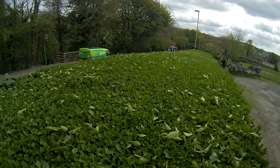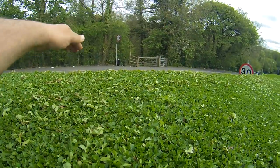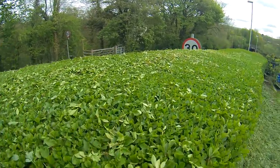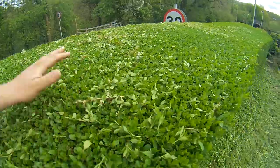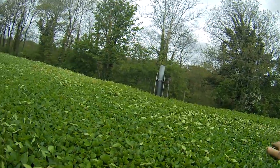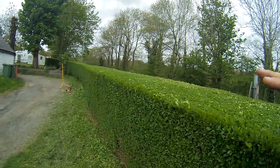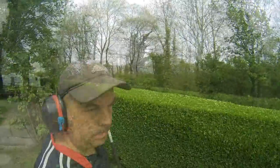What I'm doing here, I'm flattening it out first, then I'm shooting it over a bit of a bevel, like a 50 pence corner, that's the edge I've got then. Like I said, I get all these bits off, I get a little light rake out now, I pull them off, and I blow them off as well. You see, it's coming pretty good now, isn't it? I said, it's got a few natural dips to it, but just on about levelness of the cut, that's what you want. You don't want gouges in it, just looks professional.